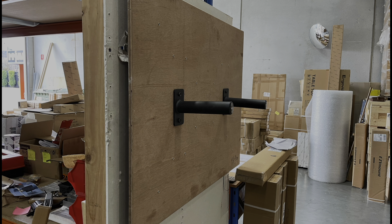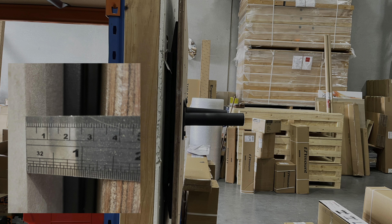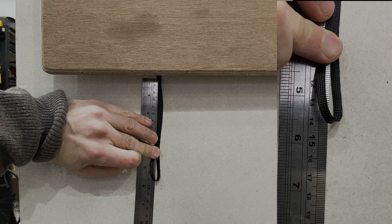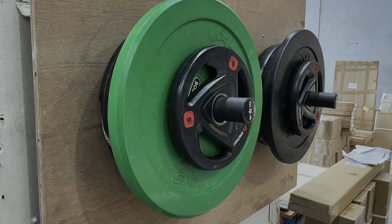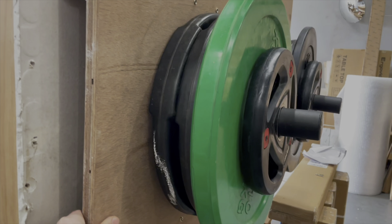Hanging it up on the wall, it's specified to sit 32mm from the wall, which looks about right — 32mm is actually quite close when you have a look at it. The TV release cables sit about 140mm from the bottom of our 65-inch TV, so that's about right. There's no need to use the weight collars here as the board isn't sagging forward at all. We've got 100 kilos on it and it feels really solid — not moving at all.